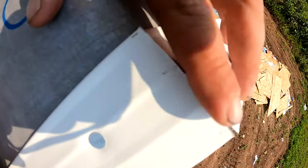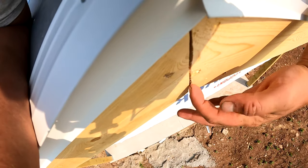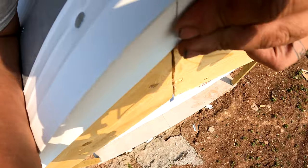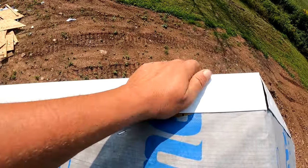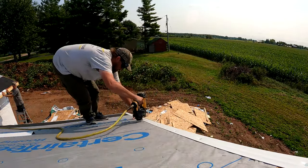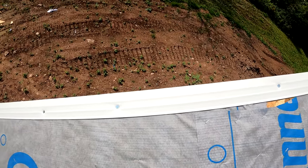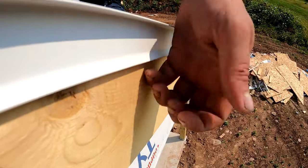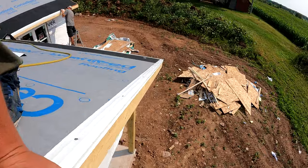This is nice and tight up here — there is a little gap but that'll all get covered by ridge shingles. You can put a tab there if you really want. When we cut that on an angle, it lines up with our fascia cut right here, and when they put on the aluminum fascia this will all be nice and straight. Now we're ready to nail the rest of it because this is nice and tight to the fascia. We're just using regular inch-and-a-quarter roofing nails and a coil roofing gun — nice and tight to the fascia so they can slip their fascia right up underneath. Everybody's happy.